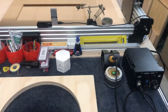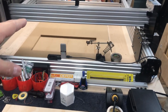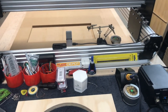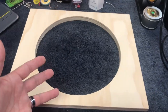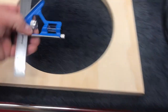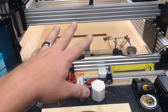The point being is: just do your math and make sure you've got all your pieces worked out. The beautiful thing about this is I know that when I cut this thing out it is going to be dead nuts square. I know it's going to come out exactly to dimension. I don't have to worry about my miters. If I know I need a 45, I can cut out 45s on flat pieces. If I need to do a chamfer, I can put a 45 degree bit in there and run a chamfer along the edge.